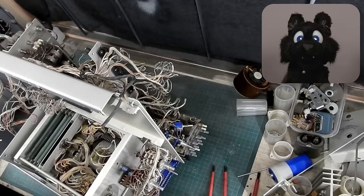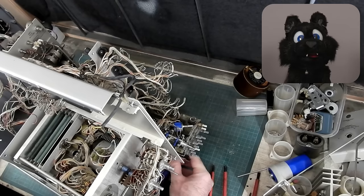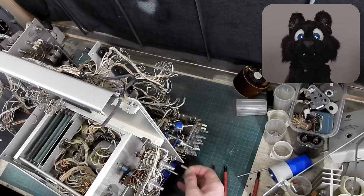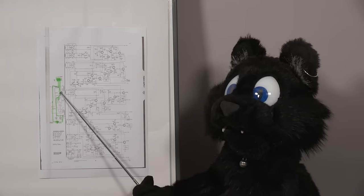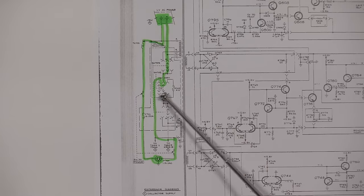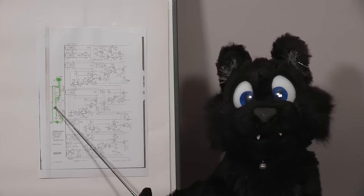Before I forget about it, I did find a bit of footage when I discovered a loose resistor nestling across one of the test fixture sockets. That could have ended nasty. That particular one has the full, or half, 115 volts mains voltage across it to power active test fixtures. Now, even with the fuse, that can leave a mark.